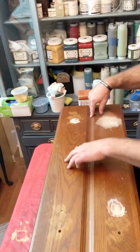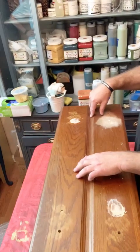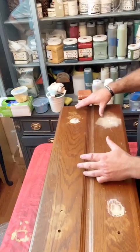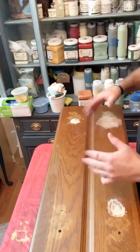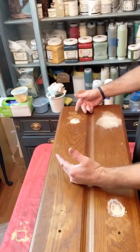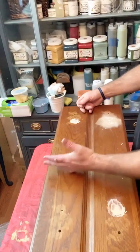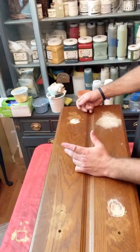Because I use 2 different drill bits to do that, you're constantly going to be changing your drill bit. So it's nice to do everything step by step on all the drawers at one time. Put them all together, lay them all out, so you can just go along and do them all at once. Otherwise, you're going back and forth, and sometimes you get confused. You forget where you're at, and you might be puttying something. You putty up half the holes in one drawer, you fix half the drawers, you go back, and you forget that you didn't fix the rest of them.